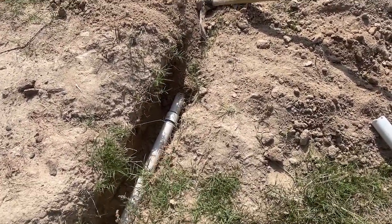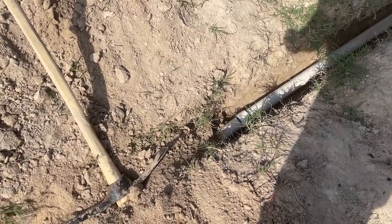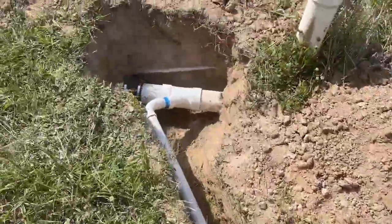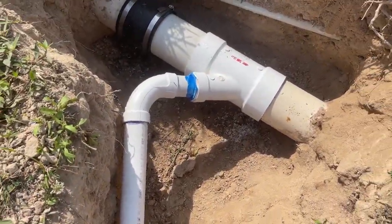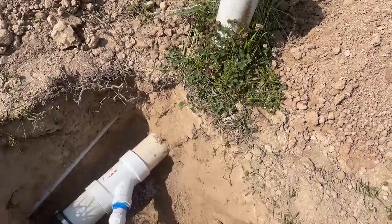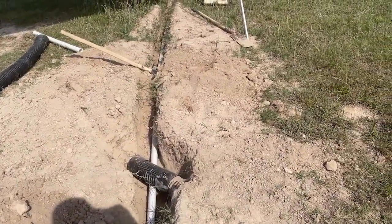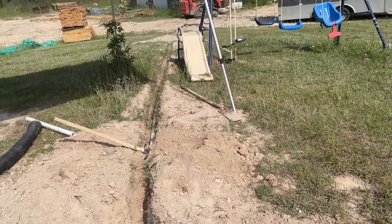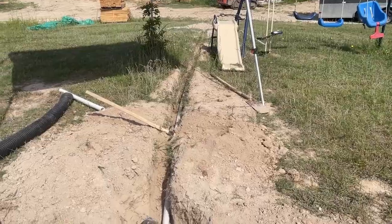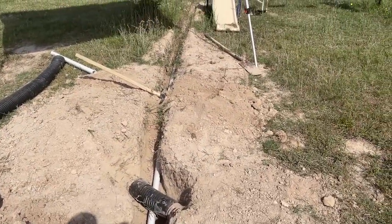The final connections are in. Peter got me my elbow — there's the final coupling on the main line, and that's where I made my very final connection. I connected up at the elbow and then picked these two pieces of pipe up out of the hole to get the coupling on one end and wedge them back together and shove them down in there, and it lined up real nice. You can now see the sweep coming around into the Y — our sewage is going to go that way. We've still got our clean-out right here to access back up into the house. If we ever have anything in this line we can go through the sump pump as a clean-out, or take out the check valve and access there — so we have options. I'm going to let this glue set and then run some water through it and see what happens.